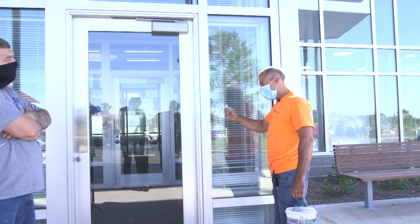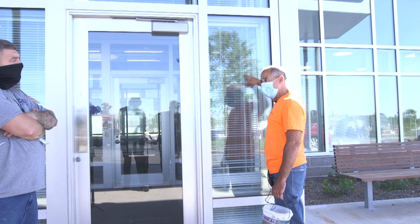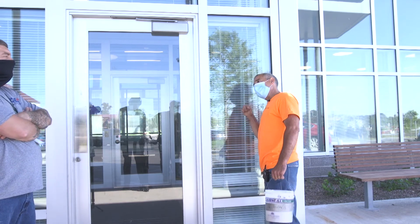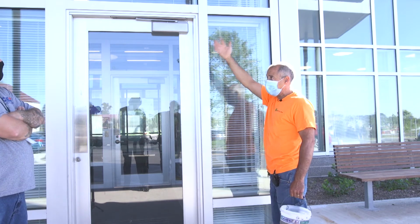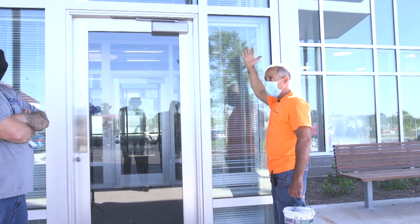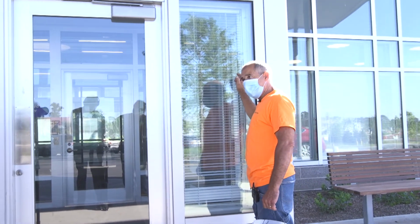You would shoot that, 1 inch by 1/4 inch thickness with new glazing, and you would set the window into new glazing. That's when you can't get to it because it's a spandrel unit and there's ceilings in there. Floors, ceilings, however.